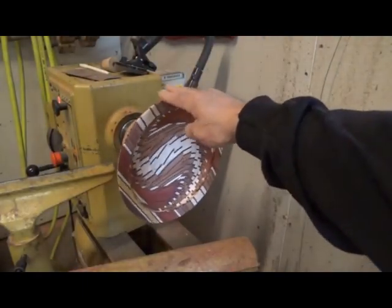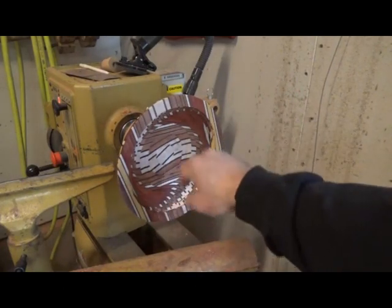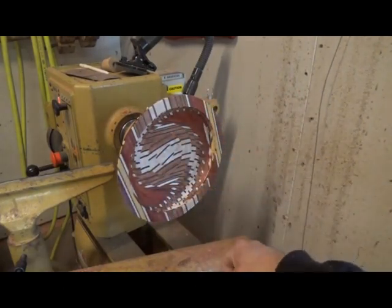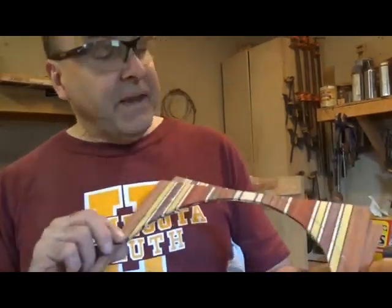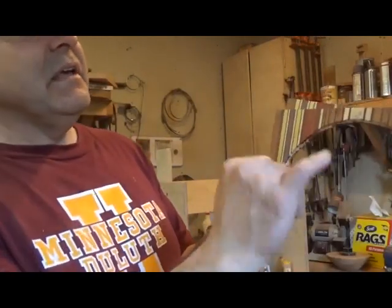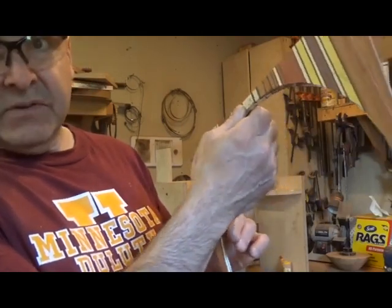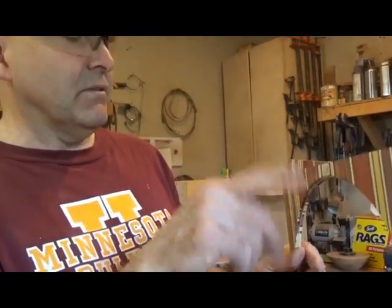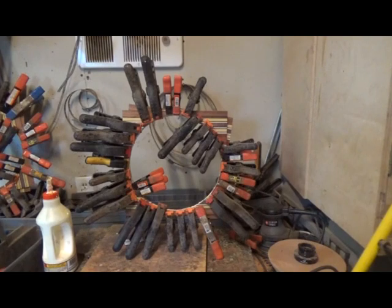This last pair of rings — what I did is I started going the other way. You can see how I was going this way, and now I'm going to go over that way. So I started out clockwise, and now I'm going counterclockwise. This is with ring 30 on now, getting towards the end. This is the last pair of rings I'm going to be cutting out. On the last six or seven of them, when they get so flimsy and thin, they have a tendency to break apart if you're not careful. So what I do is glue them together before I cut the outside on it. You can see the offset there. Once the glue is dried, take the clamps off and then cut the circle after the fact. Let it dry, and then I'll cut her out and put her on. They're a lot stronger with that twist on them.